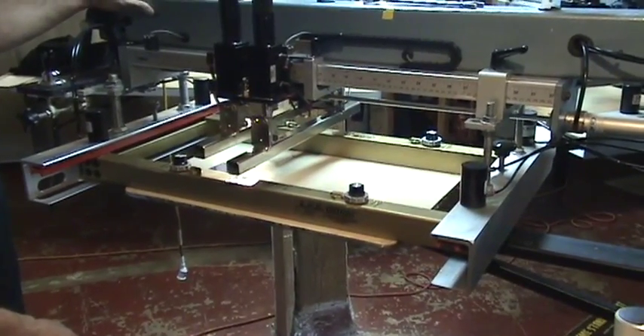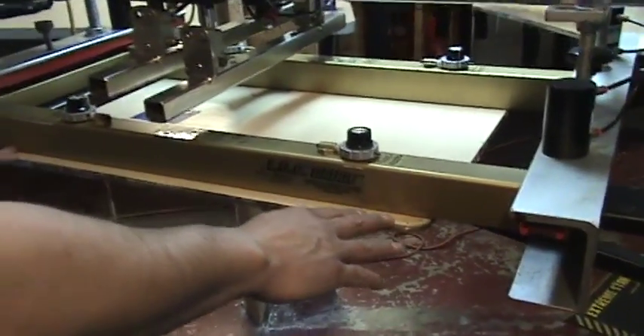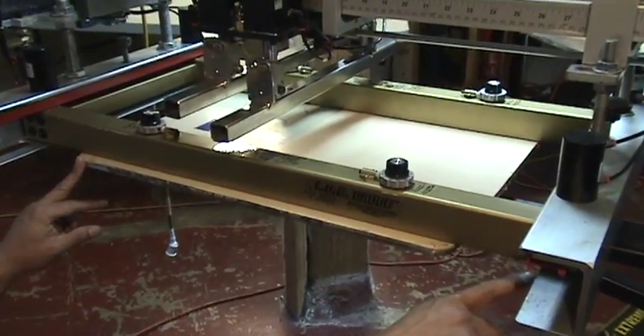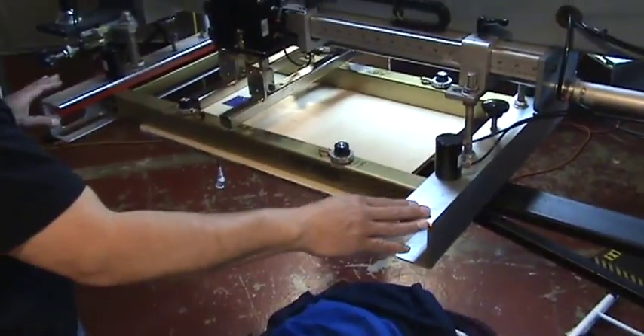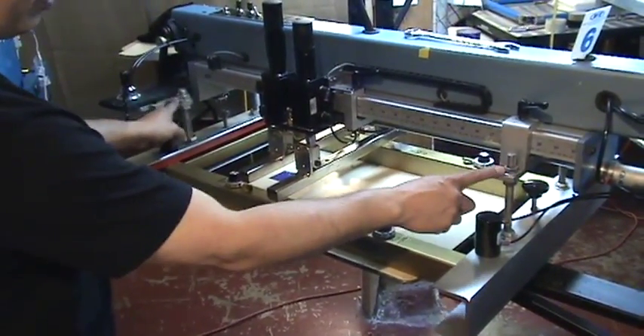Now raise the master palette up to the LOC gauge. You'll notice that all four micrometers are sitting directly on the top of your palette, but the frame holders are too low as shown in the rear and front at approximately a quarter of an inch. To correct this, we must now adjust the frame holders in the front and rear up so that they are level with the LOC gauge.